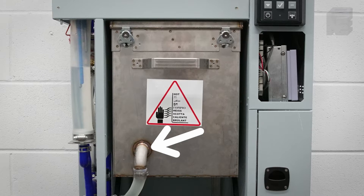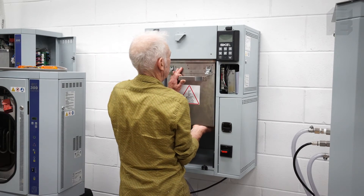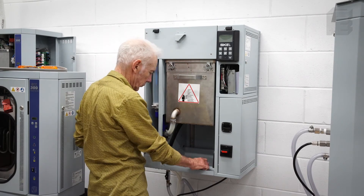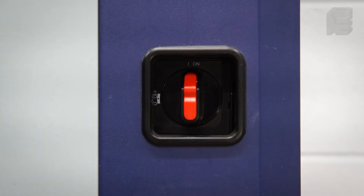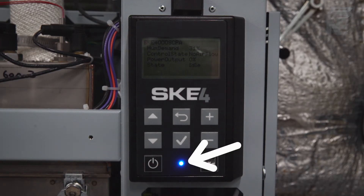Make sure the fill drain water orifice is clean. Slide the reservoir back up onto its rail support, lift it, and close the clamps. Connect the water supply to the reservoir, power up the unit, and switch it on. Press and hold the on/off button for several seconds until the blue LED lights up.